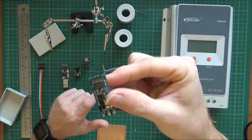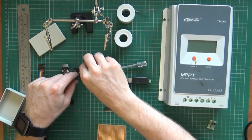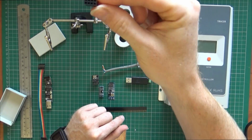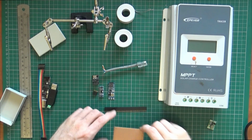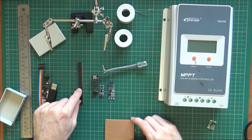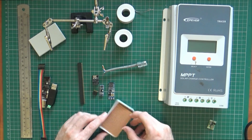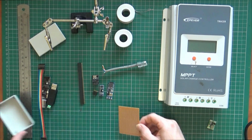This does need 5 volts, but that's great because we can feed that straight off the COM port. So we'll do that. You've got the 8266. This is the programming items. I'll put a little block connector so we can remove the 8266 if we need to do anything with it in the future. We aren't going to need him. Another strip that we could maybe use for these guys and for doing some little connections. So yeah, it's just slightly off on the sizing, so what we'll do is we'll trim it down, I think from between 16 and 17.